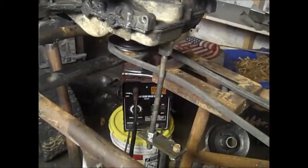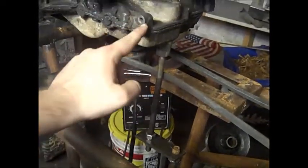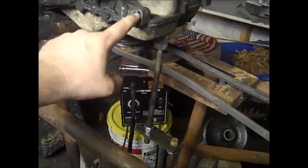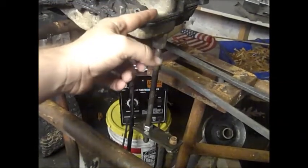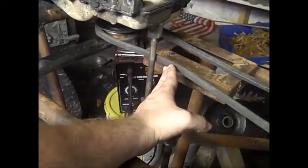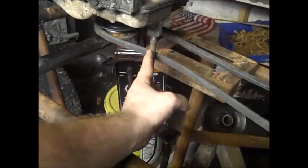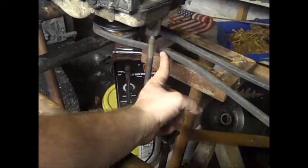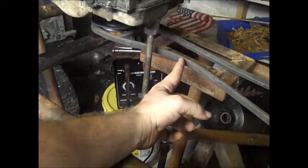And then back here we got to make the bracket that comes out, and then we got to make it go up for that transmission brace, in which that hole is stripped out. So I got to drill it out next size bigger and drill it the whole way through. And then also I got a 3-inch pulley on the back. It's 3.5, and it hits the gear shifter, which I knew was going to come about. All I'm going to have to do is put a pulley right here, or right about here, just like an idler pulley, just to keep it away from that.